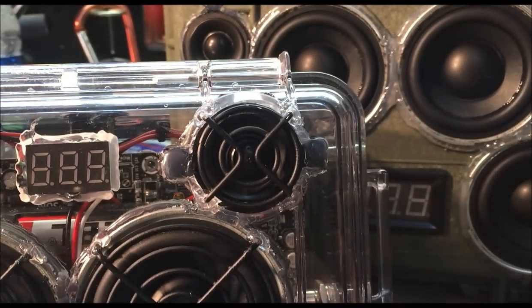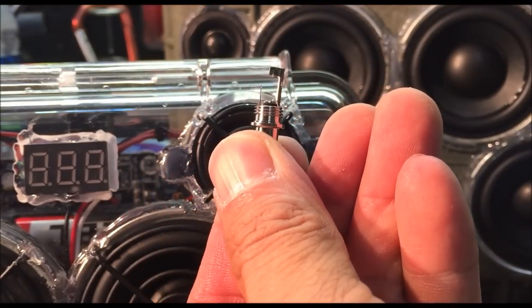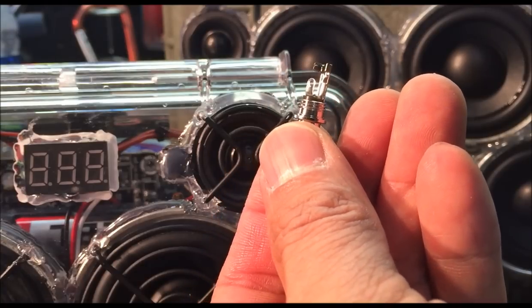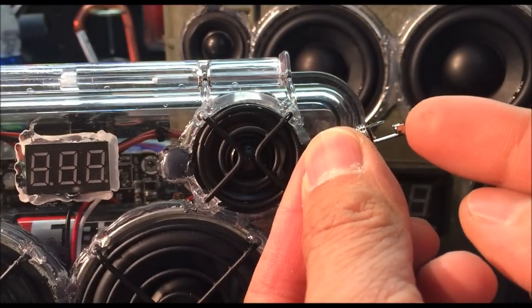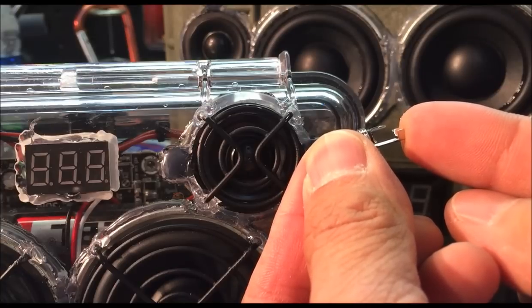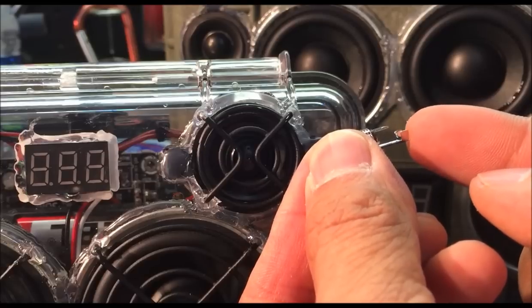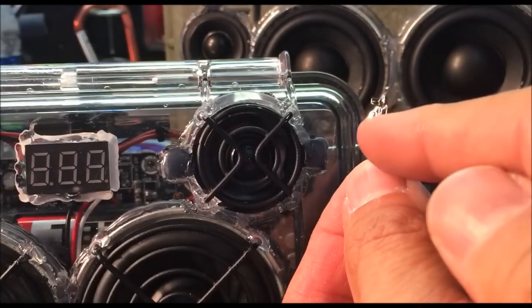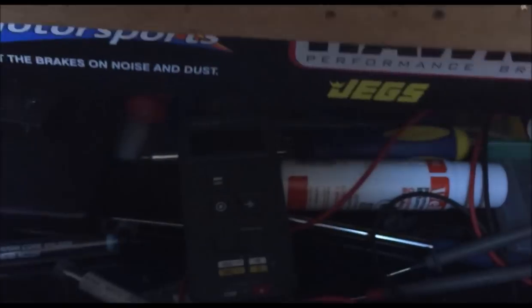You want to make sure you wire these up to the correct polarity. By default, the outside part is negative or ground, which you wire to the negative of the battery on the female side — or the negative of the power supply if you have a wall wart or low DC supply. The other conductor is going to be positive. Always make sure you use a decent multimeter to check connectivity and polarity.